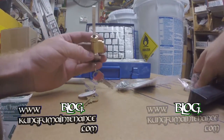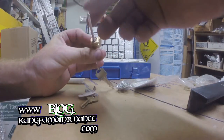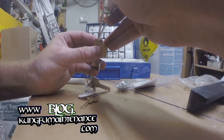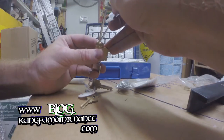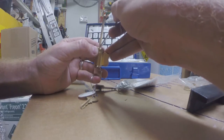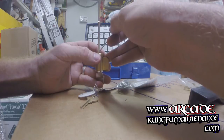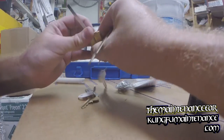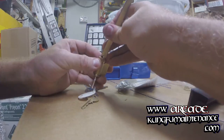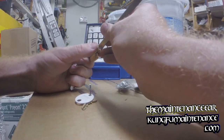What you may need is a special rotating tool to rotate the back off, because this has a locking pin and a screw. To get around it, you can depress the little locking pin with a tool and then take the back off just by rotating it once you depress that pin. It's easier if you have the tool, but if you don't, you can use a flat head screwdriver to press it down and rotate the back cover off.